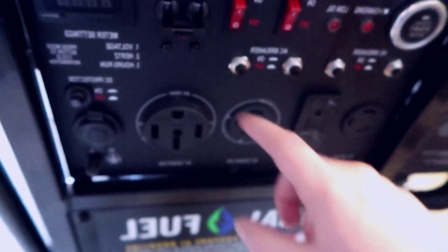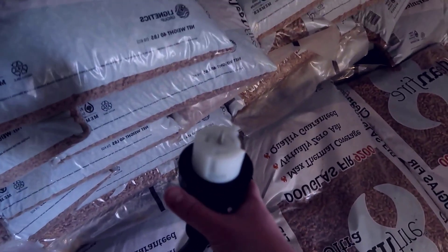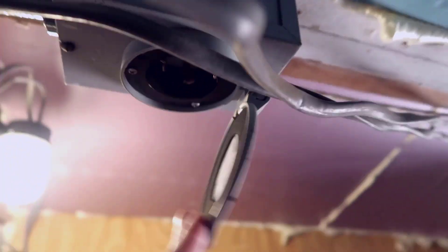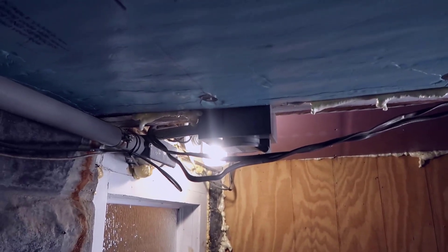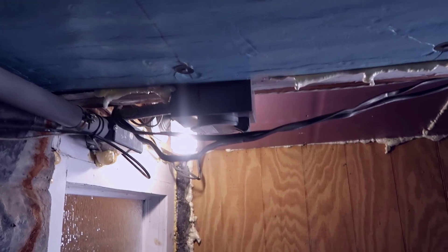You have your large AC adapter here — this is your 240-volt outlet. I have a cable that's around 30 to 40 feet. I connect it into the generator, and the other side connects into a 50-amp box I have here in the same space. The previous owners installed this. I then connect it into my panel, and I use a manual transfer switch on the outside of the house to get everything up and running so we're not drawing power from the grid.